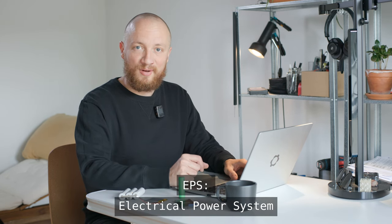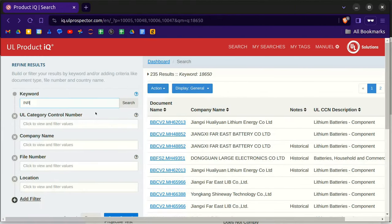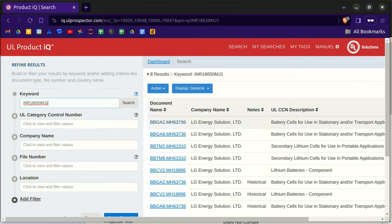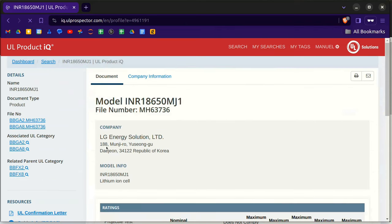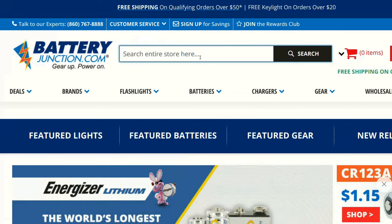So that's about 50Wh, which I hope will be enough. My reason for doing two in series is that this way I can only use buck converters to go to 5V and 3.3V instead of using buck-boost converters, which should simplify the EPS design a bit. Now armed with all this information and an actual part number, we can go back to the UL website and search for INR 18650 MJ1. Note that the INR variant is definitely the one we want because the LCO is the one with the lithium cobalt chemistry.